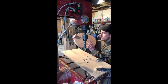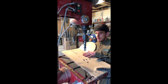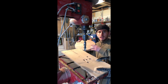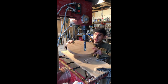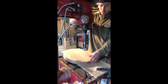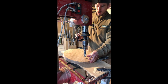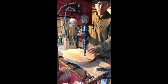Now that we've got the marks set out on the top, I've got a sacrificial board clamped onto the drill press here and it's got another one of those little pins like I had at the router table to get the circle. So now I can just sit the seat in there and set a perfect center point. All I need to do is line up the hole locations, clamp it in place, and then I can get the three holes nice and consistently at the same angle.